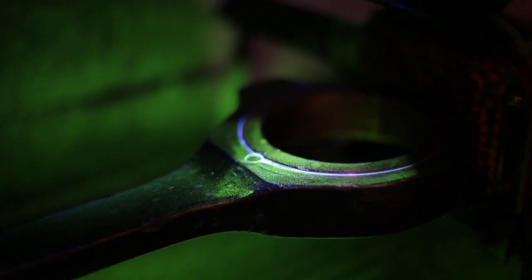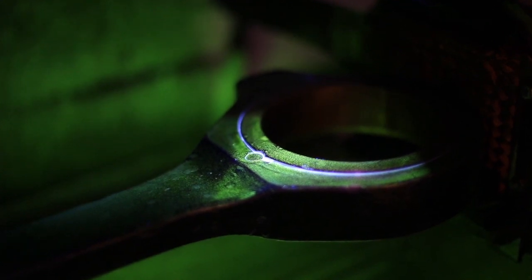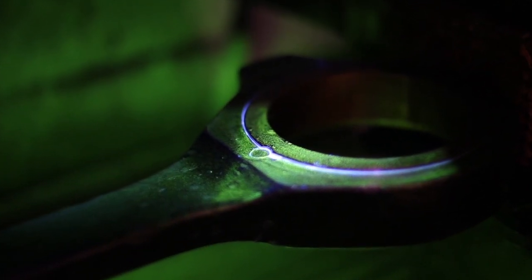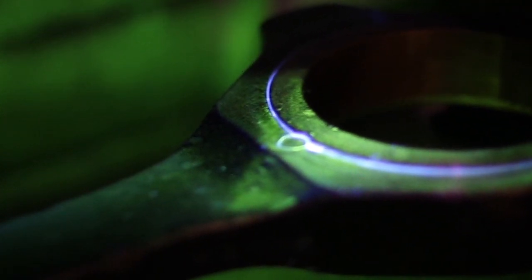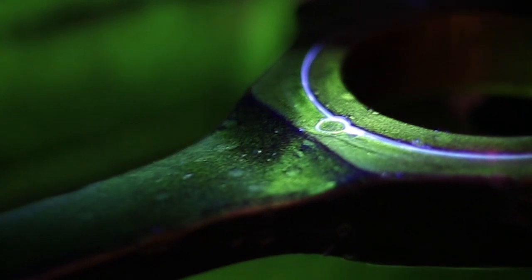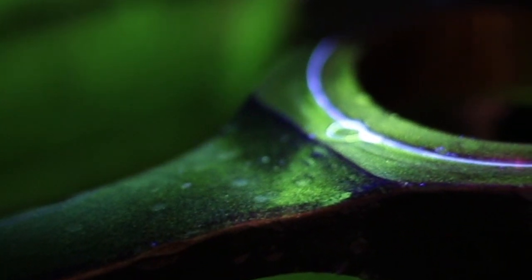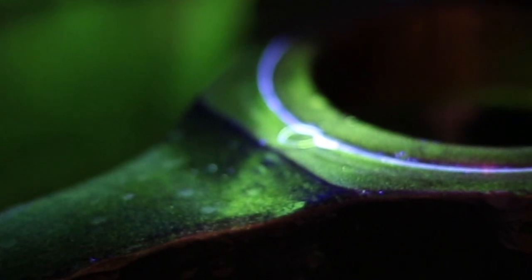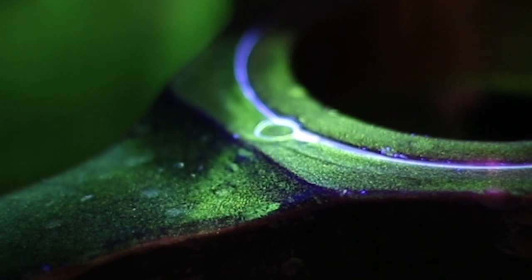If you look right here and see this pin — that pin is supposed to be there. But the magnetic particle test actually picks up that it's not fused to the steel, which it's not supposed to be. You can see that we picked that pin up in that material because there's a gap between it and the steel. That's what an indication would look like if there was a crack anywhere on this rod.